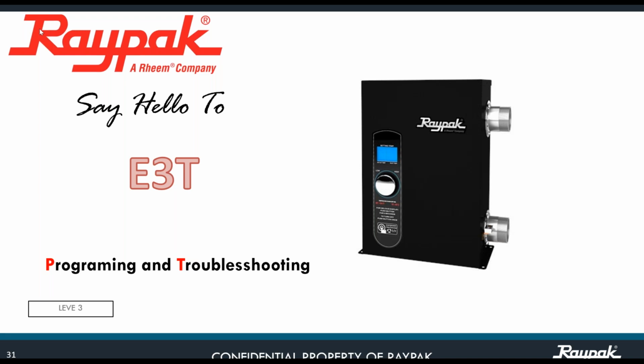Consider the space for someone to fit in the area to fix it in the future. Yes, you are right, Davis. Remember, you need to leave space, especially if you are going to service the unit. Recently I saw an installation where an electric heater was installed dangling from some metal attached to a wall. I said, where are you going to do the service on this? And they said, no, don't worry about this. Yes, it's a worry. This is not a wall-mounted instant water heater. It's supposed to be on a solid base. So thank you for that observation. Yes, you need to leave the proper space for service.